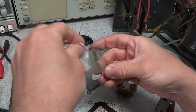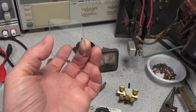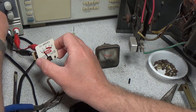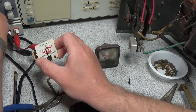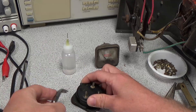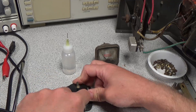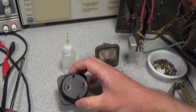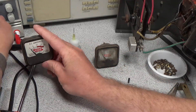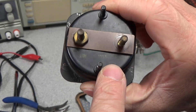Cleaning the glass is done very carefully — I don't want to break the only glass piece I have. With some video magic, look at that: nice clean glass. Doing some functional checks while putting things back together is important to make sure things actually work — nothing worse than putting it all back together and finding out it doesn't. One of the most annoying parts of these meters is the little metal tabs around the perimeter; you have to bend the tabs up to get it apart, then bend them back over to close it, and there's only so many times you can bend those tabs. Somehow managed to not break any tabs in this entire repair. On the current meter we can see the same 1955 date code as the capacitor, again verifying this machine is from the mid-1950s.